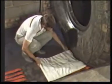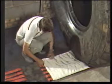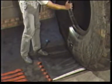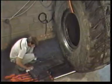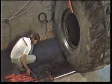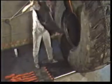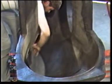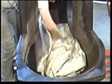To assemble the system, first lay out the harness and place the selected flat airbag in position onto the harness. After treating the outside heat pad with a release agent, place it onto the flat airbag. Lower the tyre onto the outside components. Treat the inside heat pad with a release agent. Position the inside heat pad to completely cover the patch being cured. After placing the inside flat airbag and the inside cylinder bag over the heat pad, slightly inflate the cylinder bag and check the position.